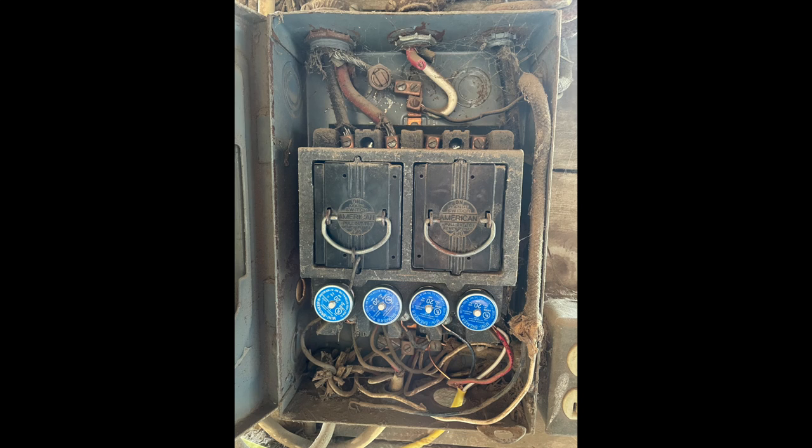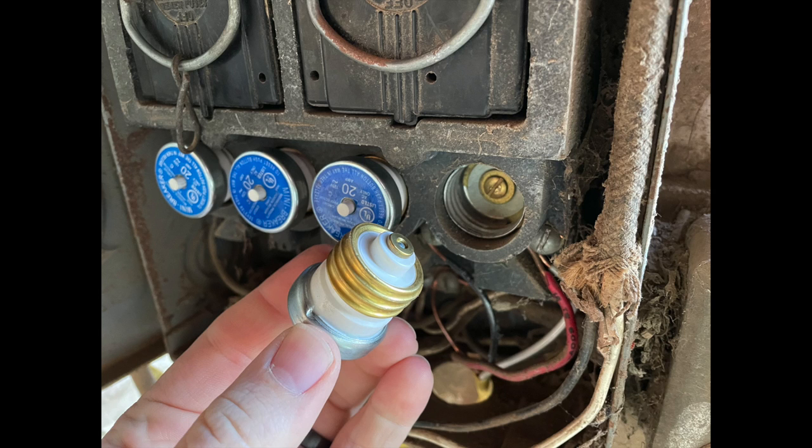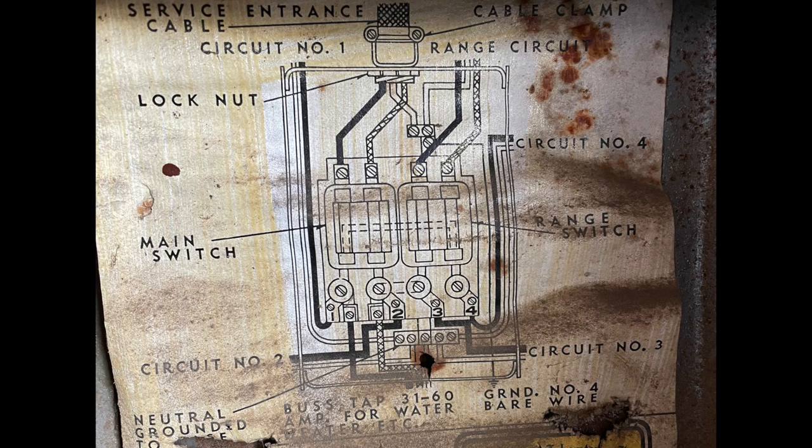Those fuses were going to the other side of the shop, which is not used all that often, but if it is being used, I probably won't be able to run my 220 without tripping one of the two breakers — and I say breakers specifically because I replaced the fuses with Edison-style breakers. Another thing to point out is that there is a way to hook directly to the main breakers to get 60 amps on either leg, but since I was only doing 20 amps per leg, I didn't consider this. If you have a welder you're looking to hook up, this may be an option.